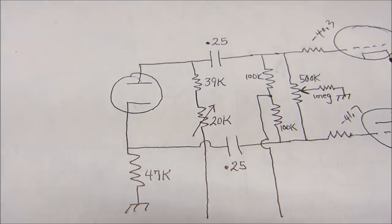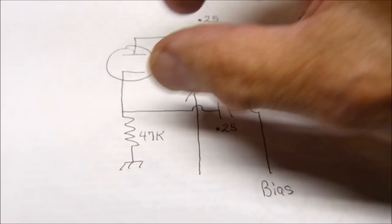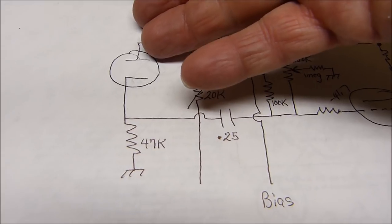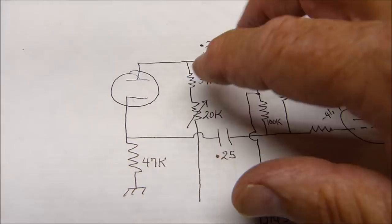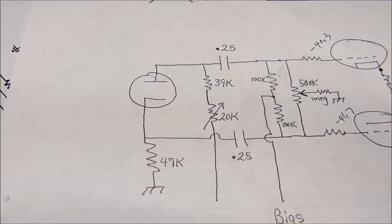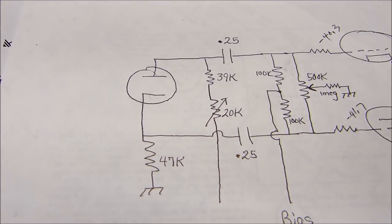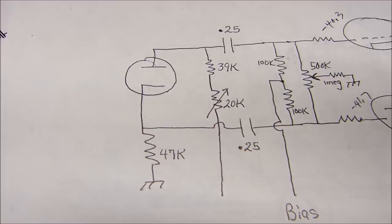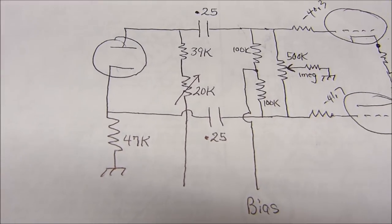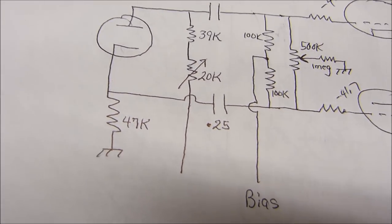I'm going to turn the amplifier off, unplug it, and we're going to measure the value of these resistors. Let's just see how different they are. And it's going to be unique to this tube somewhat, what this perfect balance is. But we did find the perfect balance. And we could go either side. We could go real far on one side and just barely on the other. I hope you can see that we could actually cross the perfect straight line. So let's give this thing a couple of minutes to completely drain, and then we'll actually measure these resistors.